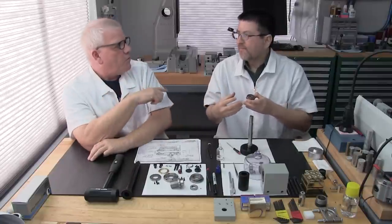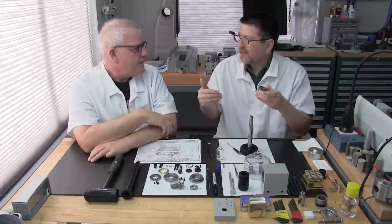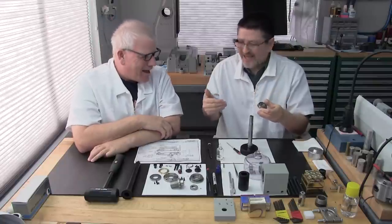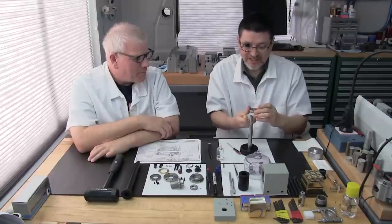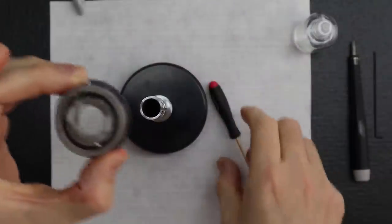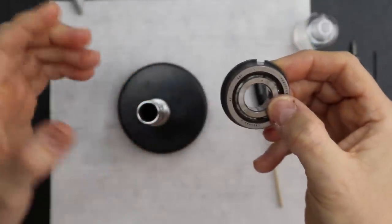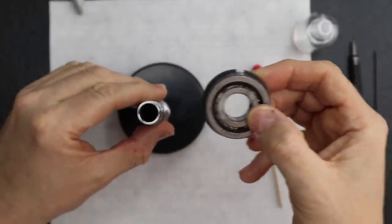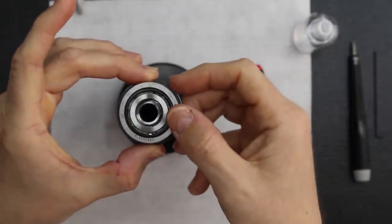So we're creating a bigger oval, and we're trying to make an oval back into a circle. Yeah, trying to cancel each other out, as near as that'll get. So very important, you definitely don't want to match it because then you're going to add to the run out. So just like that. You just want to take your time. Remember, the witness marks facing on the spindle are facing me. The mark on the bearings is facing away from me.